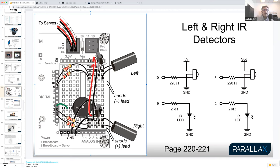Then looking at the ground connections, you're going to come from GND up to the center pin of the lower of the two IR receivers. And then there's going to be another black jumper that goes to the center pin of the upper of the two IR receivers. Those center pins of each IR receiver should be sharing with the shorter pin of the infrared LED on that same row of 5. These are all things to double check as I call them out.